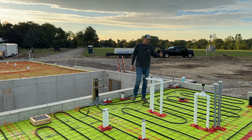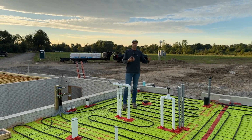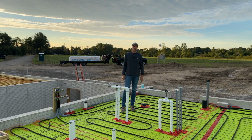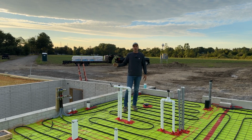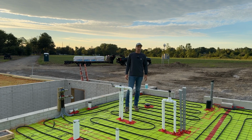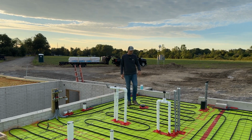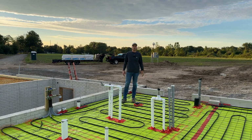You can imagine if they're swimming in here and it's taking all the moisture out of the air, well, it's actually just evaporating off the pool. So if we didn't recirculate that back, they'd be constantly having to fill that pool with more water. So we got the system in here that when we take it out of the air, it puts it right back into the pool. So it keeps the water level in the pool at a good level. They never have to refill it because of the way we are running our systems. We also have drainage in here in case there's a water leak. This is going to be a floor drain in the middle, but we got this pool room all set up.